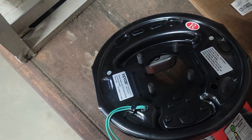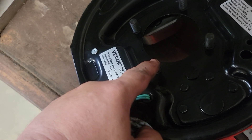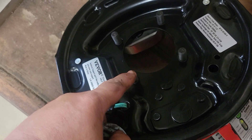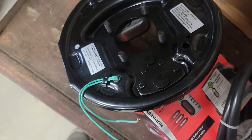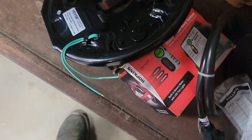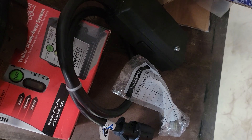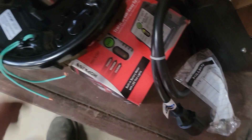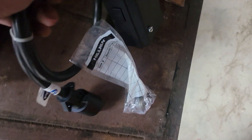What's surprising is yes, made in China, but I went to the hardware store and took a backing plate with me figuring these are metric — they are not. They're 7/16-20, so they're SAE. I had to buy lock nuts and hardened washers.